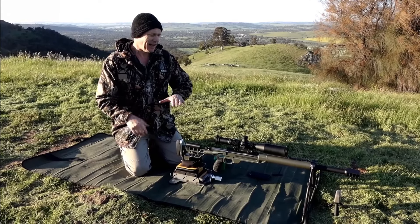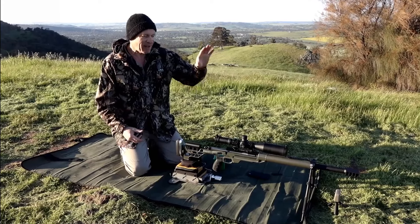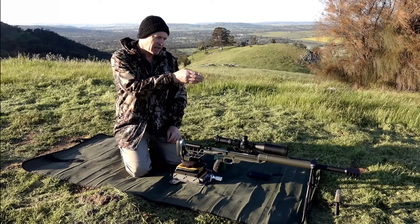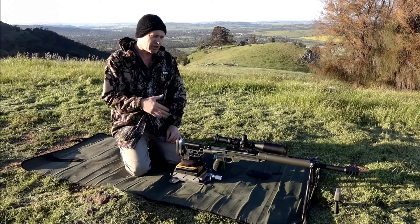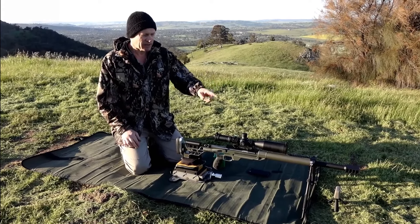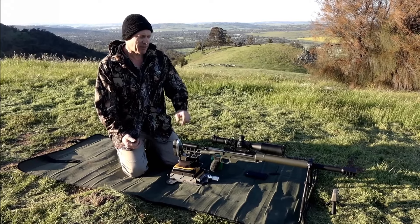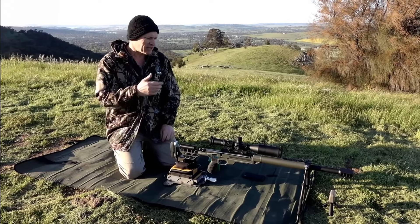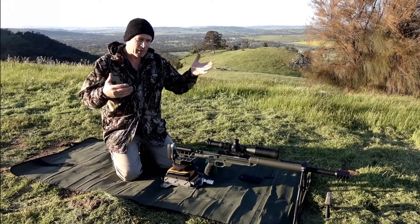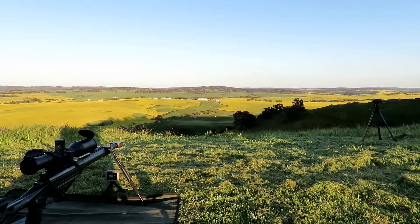This barrel is an average 45-cal barrel we had machined up. It was modified to 45-120 for a while using a 24-inch barrel, then we went to a 30- to 32-inch barrel from Swans for the 45-120, taking that out over 3,000 yards. Now this barrel has been rechambered back to a standard 45-70 chamber — 22-inch barrel, 1-in-14 twist — pretty much what you'd find in a lever action or old carbine, but set up in a quality action and chassis.